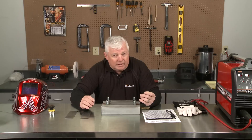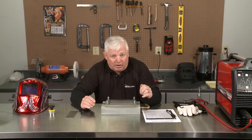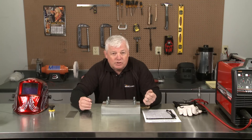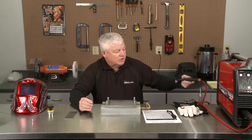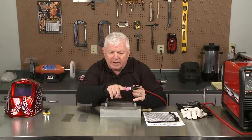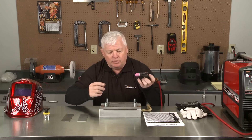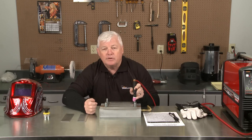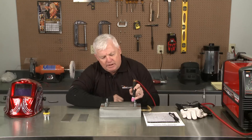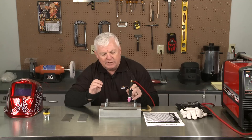One of the concerns in welding this material is the chromium — when you get it activated, when you get a puddle, oxygen is going to try to attack it. So with the TIG torch, we have a gas lens. This particular TIG torch has a gas lens, a 1/16th tungsten sticking out about a quarter of an inch, and that's going to be our standard. So I've got good gas shielding. The part is set up here and tacked at both ends. I'm going to get good gas shielding, and as I weld I'm going to dab consistently.